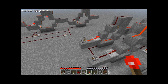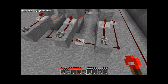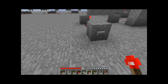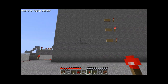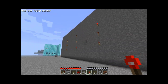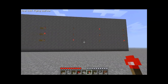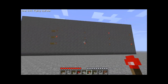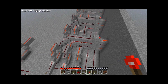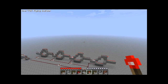So with one on, say you want three next, then one again, then two. As long as you're clocking all of them it'll work. Now look at the display board — you can see the exact order you pushed the buttons. From right to left: one, three, one, two. That is order-sensitive memory. For the release mechanism, I had the outputs of every one of these set up with AND gates so they are time-released in the order that I pressed them.